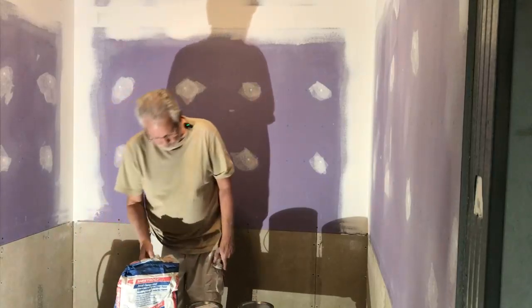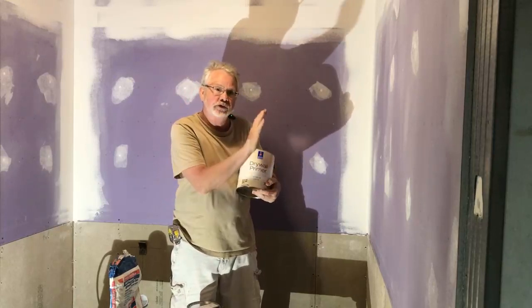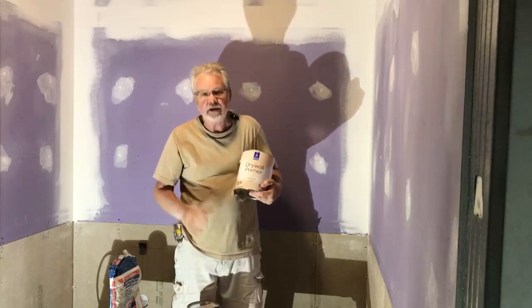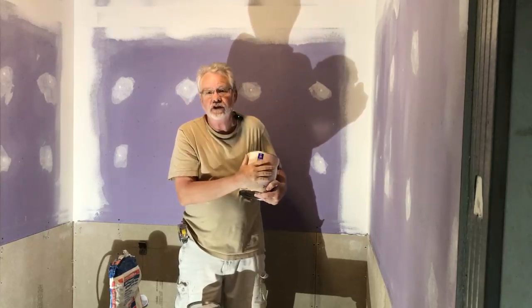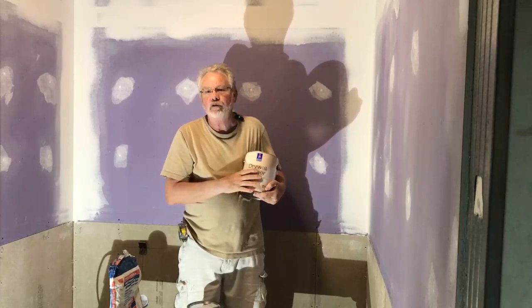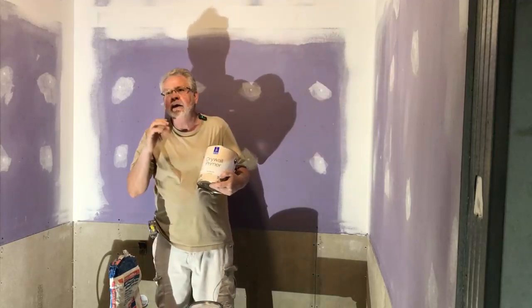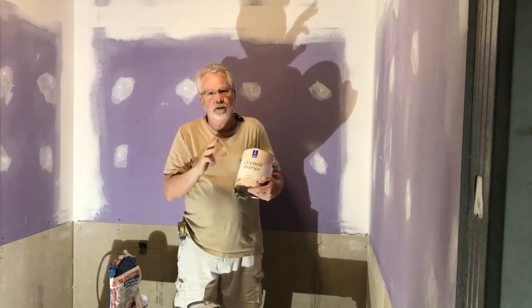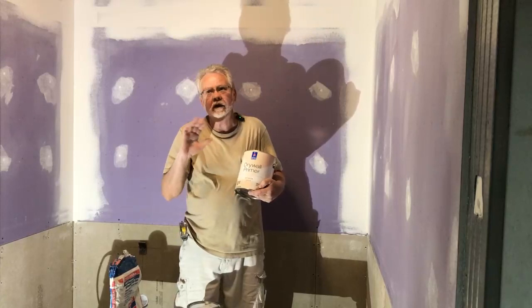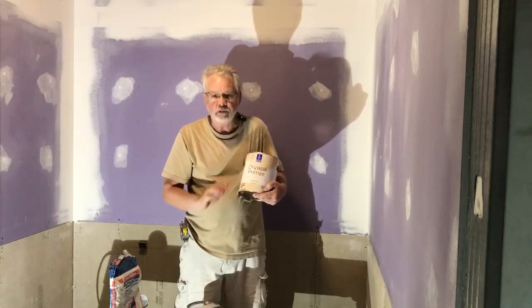At this point we're ready to start painting, and the first thing we want to use is a drywall primer. The drywall primer will seal the drywall and seal the mud so that your paint doesn't keep soaking into the product — definitely a good step. After applying it takes about an hour to dry and then you're ready for paint. This is also a good opportunity: if you see an imperfection in your drywall you have a chance to touch it up before the paint. Pay close attention — if you see a spot that needs addressing, go ahead and do it before you hit it with the paint.